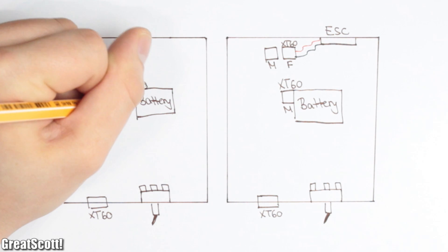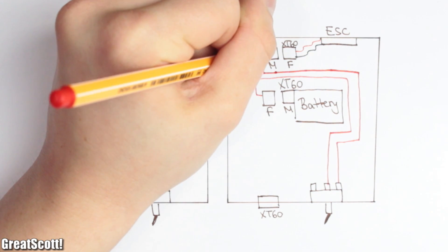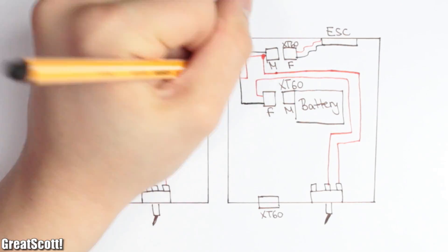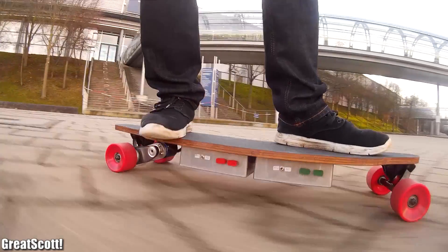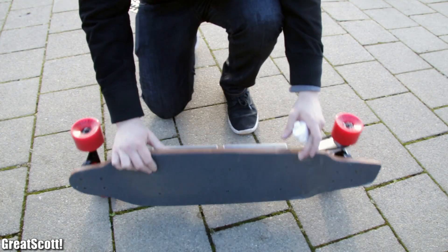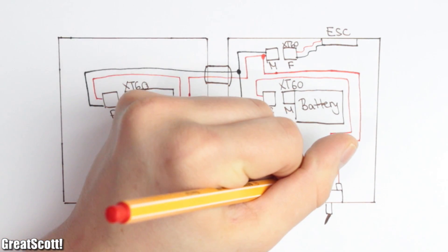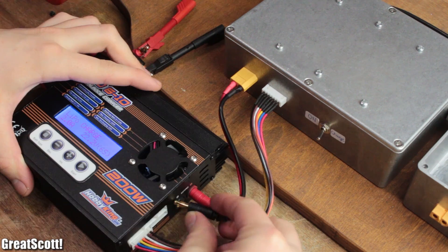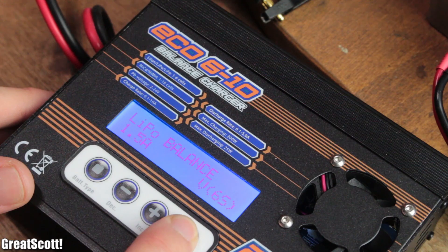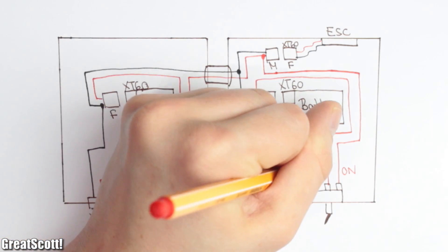Now it is time to talk about a wiring diagram. Both batteries feature a male XT60 connector and will be basically connected in parallel to the ESC, but can be turned on independently through their switches. So when riding the board, one battery gets used until it's empty and then you change to the other one. The second switch position connects the batteries to their charging ports, which can then be easily connected to a suitable balance charger that fills it right up.